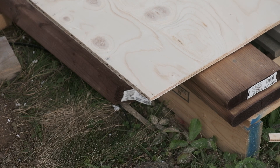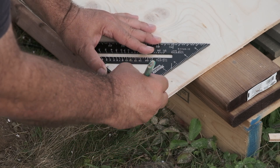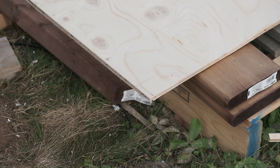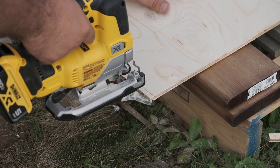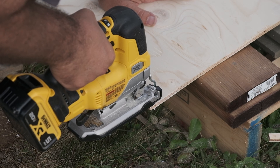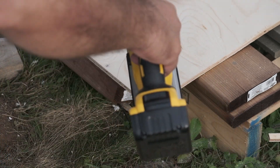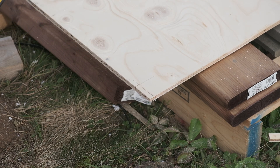We'll start work on the door here. These are pretty simple cuts — just large plates here and there — but I do have to make a few fine cuts to make room for the corners of the door. And this is where a jigsaw really comes in handy — great for these fine cuts. I know a lot of people don't like jigsaws, but in my opinion, honestly, if you have a miter saw, a circular saw, and a jigsaw, you can build almost anything. I just have to cut the other mark out of there, and if I've made my measurements correctly, this should fit perfectly into the upper corner of the door opening.